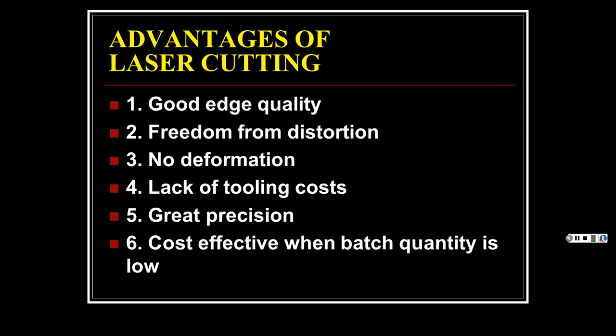In fact, it would burn that edge so it would leave a black or brown edge on it, so you'd only have to stain the top edge, and you wouldn't even have to finish the sides. With the table saw, no, you'd have to finish it, or it's going to swell on you later. It's going to get moisture in there.